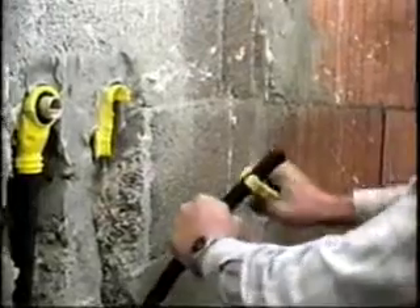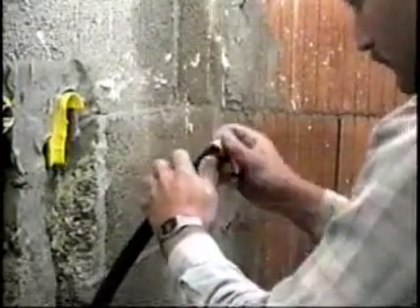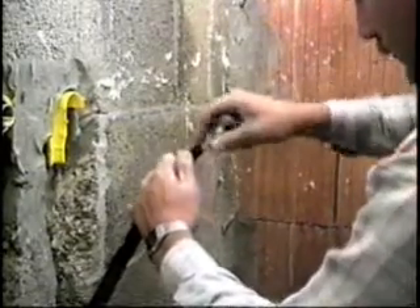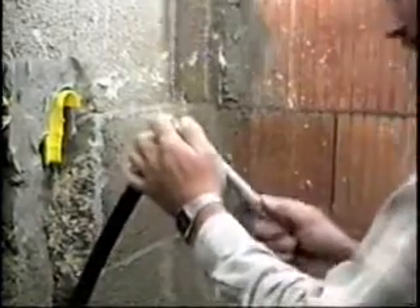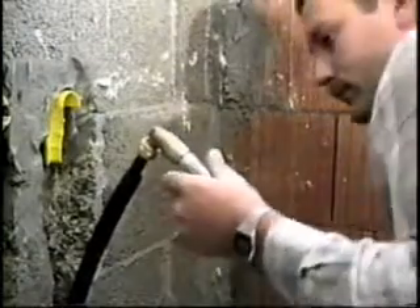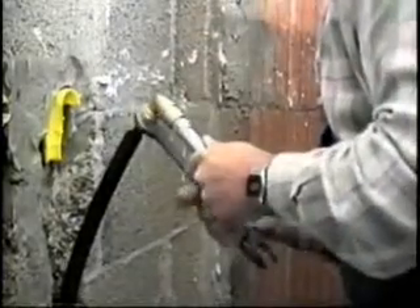The PEX pipe is now connected to the basin water outlets — these are the wall elbow assembly units plastered in position after the wall has been chased. With the PEX-A pipe system, the conduit pipe needs no additional insulation, which is not the case with soldered copper pipes. The conduit also protects from condensation and provides sound insulation.